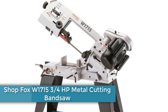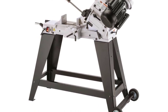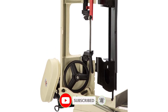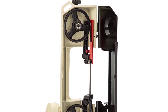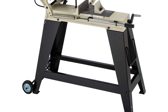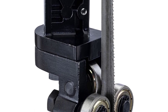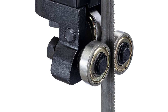Number 5: Shop Fox W1715 3/4-HP Metal Cutting Band Saw. Shop Fox produces affordable heavy-duty machinery aimed at home and small workshop users. The Shop Fox W1715 has a powerful 3/4-horsepower motor with three speed ranges, yet it plugs into a standard 110-volt outlet. Thanks to the included vertical sawing attachment, the band saw can be used either horizontally or upright. Some assembly is required, and since it weighs 122 pounds, it's a job for two people. Once assembly is complete, the wheels on the stand make it relatively easy to move around. Although the Shop Fox W1715 is a significant investment, it's a good value when compared with similar rivals.